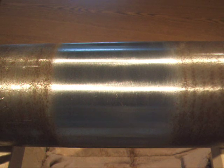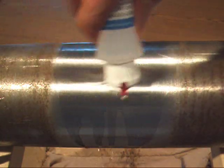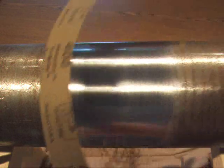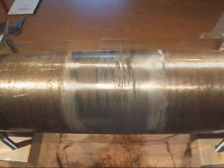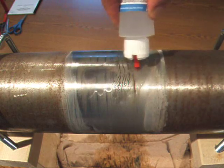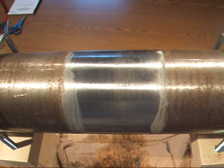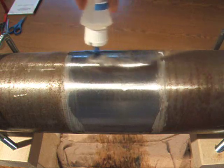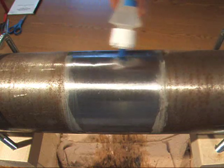I'm going to take the acidic solution and apply it to the shaft surface, then with the 400 grit paper perform a wet sand. Now that you've finished your wet sanding, you again take the M-Prep conditioner and rinse the area. Then follow it up with the M-Prep neutralizer, which is the basic solution — with the blue nozzle versus the red. Rinse it down very well.